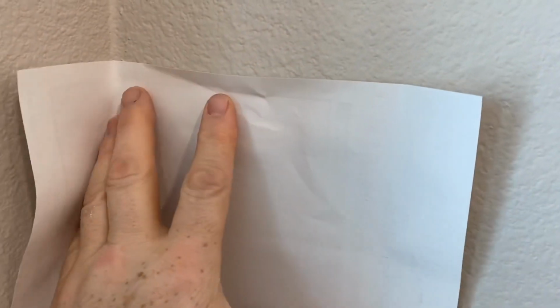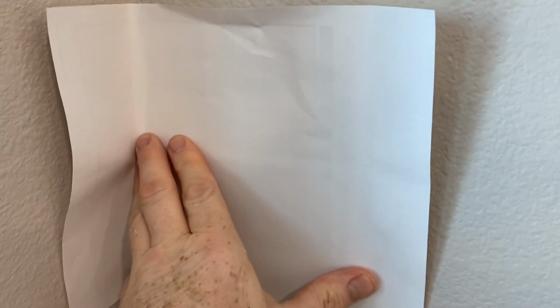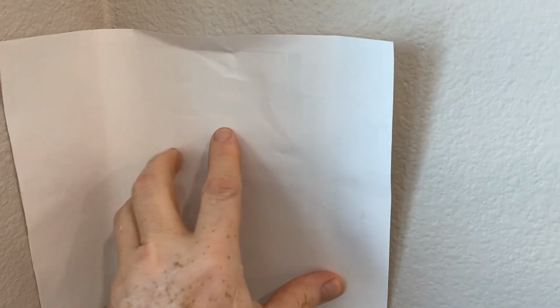However, do you want symmetry that leaves you with a 2-inch piece at the end? Or would you rather symmetry that leaves you with a 12-inch piece? This is what you want. You desire to achieve the symmetrical result that will give you the largest piece of wall covering at the end.